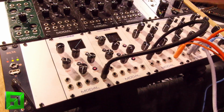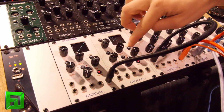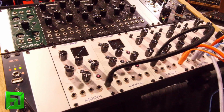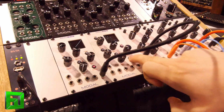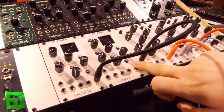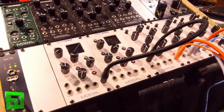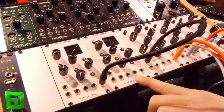You can use it as an LFO as well because you've got a low mode, and a DRS function which basically halves the sample rate of the waveform, so you can get a different waveform starting from the main one, and a very handy subwave function. The subwave basically replicates the same waveform of the main oscillator onto the sub-oscillator, and of course you have a separate output for the sub-oscillator.